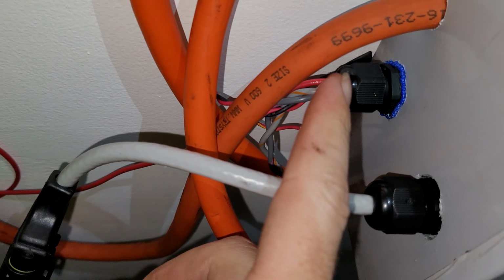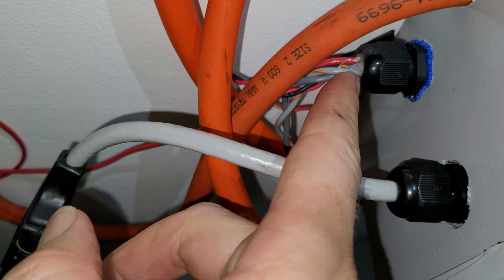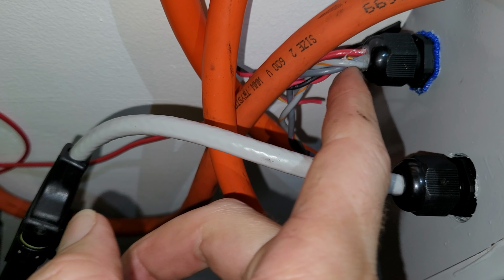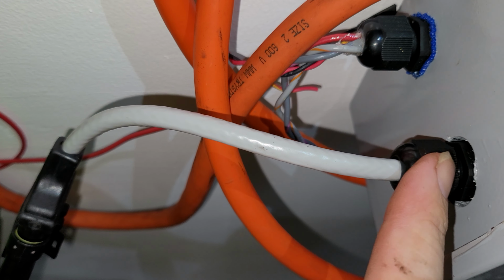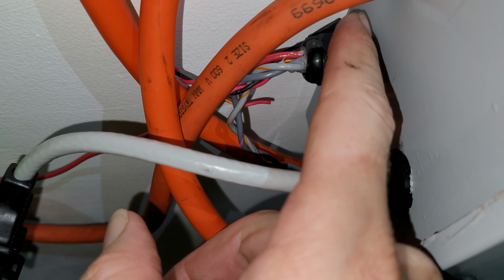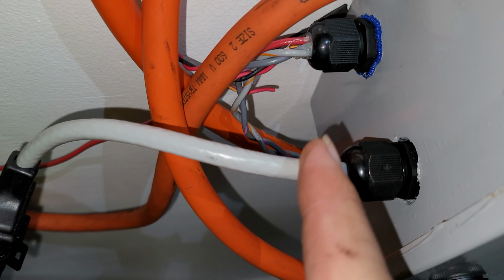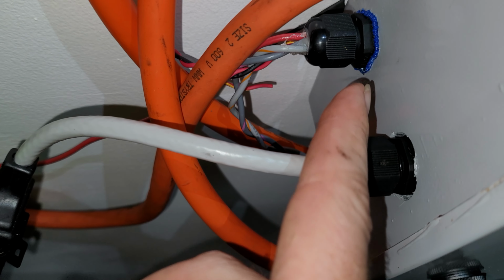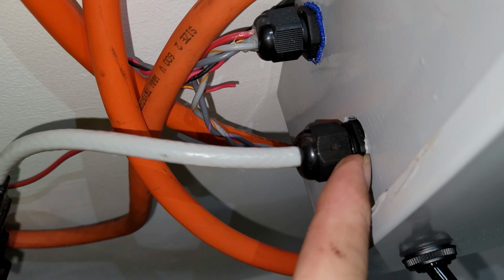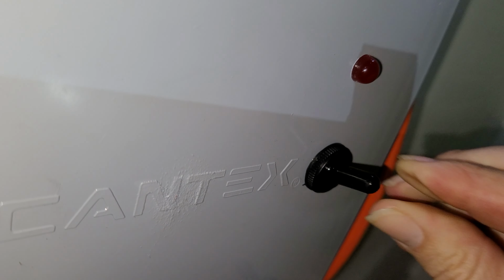On the underside, there's the watertight connection and hot glue inside to make sure that there were no gaps for bugs to follow. And that, of course, is tight. I tried plastic welding this on, and it was fun, but it was just kind of too slow. I couldn't get the nut on the back because it was too thick. So this one I had to drill out some of the thickness to get the nut on the back. The switches have the waterproof rubber boots on them.